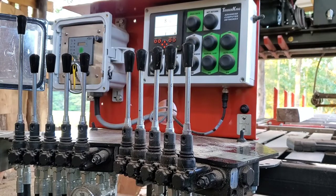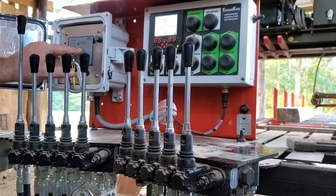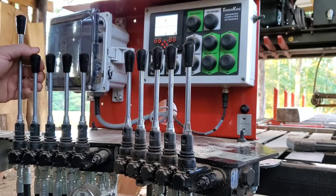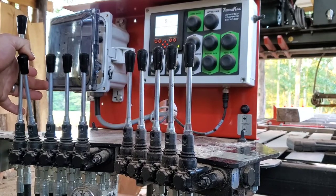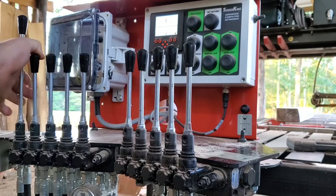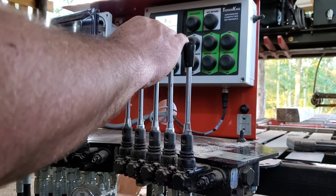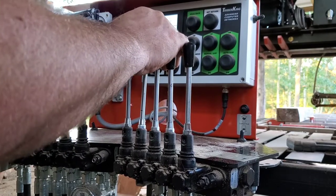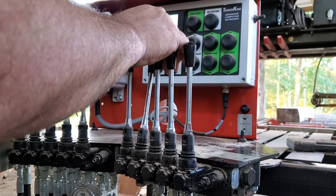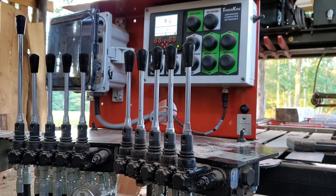So without further ado, here we go. We've got the water running. Go and crank this up. First thing I gotta do is I gotta take out my log stops. So as soon as log stops lower down, since I've got a square edge, we'll go and take them all the way down. The next thing I'm gonna do is take my log spike, bring it up, and then bring it over. I know I've got 4 inches to work with, so we'll shoot kind of below 4 inches, somewhere probably in like the 3-inch range. So get the log spike in, it's almost ready to cut.